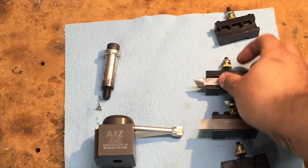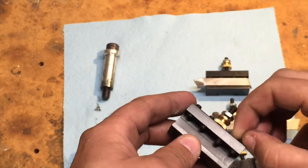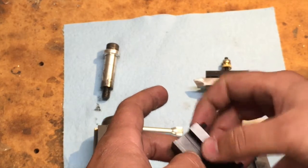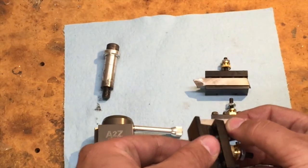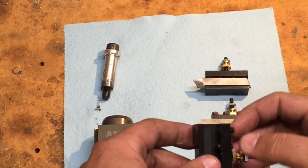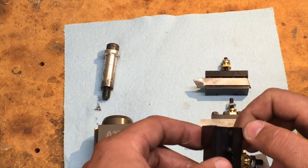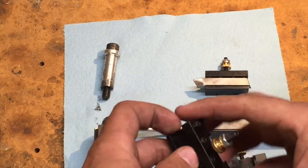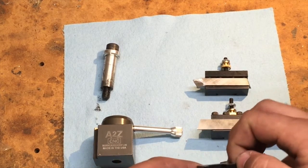One thing I noticed — I'm honestly not sure if this is supposed to happen — but these screws that hold the tool bit in place: the threaded holes inside the body were not threaded all the way through. It would only allow the screw to come out just barely, meaning I could not tighten them down to anything much smaller than that half-inch or 3/8ths dimension. I had to chase those with one of my taps so the screws would screw all the way in. The screws are American-threaded — they're 10-32 screws, which is nice, though kind of funny when everything else on the lathe is metric.